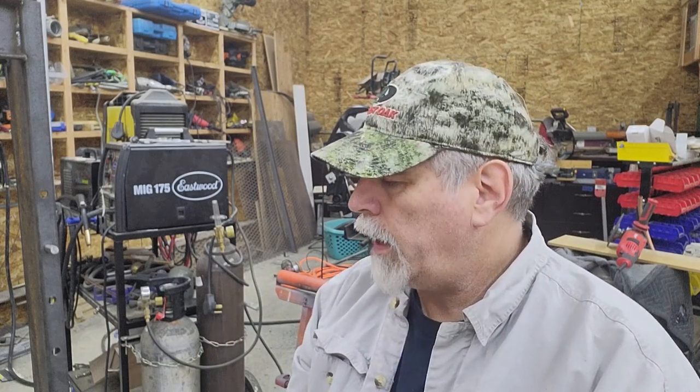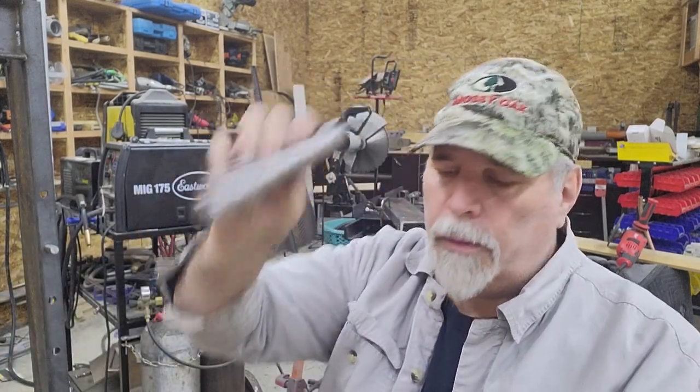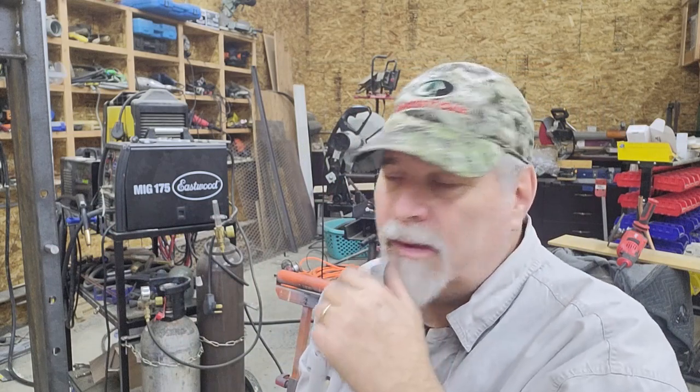Alrighty, I got those other holes drilled that I just talked about, and I did a little bit of additional stuff off camera that I'll get you caught up on. So given I'm pretty close to the assembly, I need to bolt the two tables together using these threaded spacers that you saw me make. Because it clamps in from both sides of the press's frame, I have to actually have them on the frame when I bolt them together. And I didn't have pins yet.